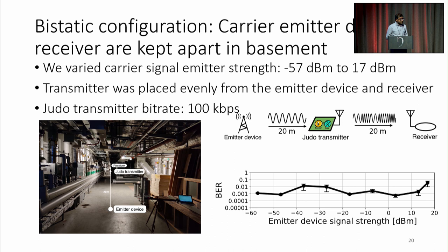Now let's take this entire thing outdoors and try it. In an outdoor setting, we'll separate these three elements, put them at three corners of a triangle that exceeds 100 meters on a side. In this environment, we can get greater than 100 kbps continuously with a carrier emitter strength of 25 dBm — again, kind of milliwatt range. So this is really a new sort of architecture — it's not really backscatter, it's not really reflection, it's not really conventional radio.